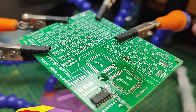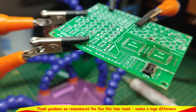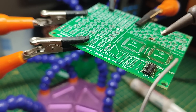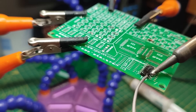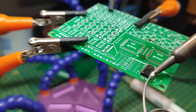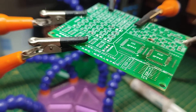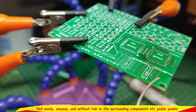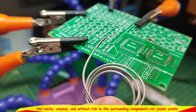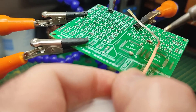Let's try it on this other chip. I've put flux on there — as Louis Rossmann says, you can never have too much flux. Put it on, make sure we get it on all the pins, and it's off! Superb. You couldn't do that without this alloy because normal solder solidifies before you get all the way around, but this stays liquid for absolutely ages.